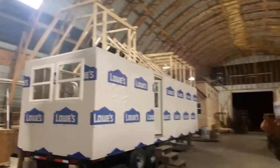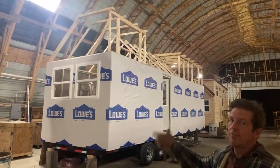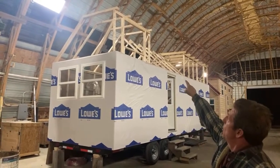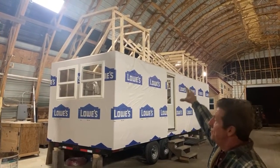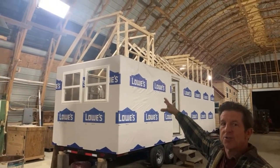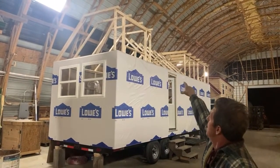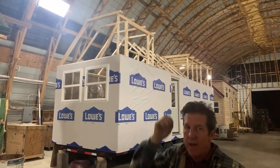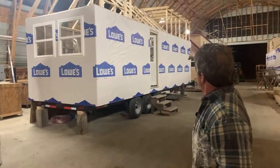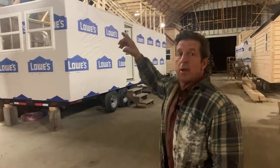Okay, framing the walls like we were down here at this one. Sheet and put your windows in. Super simple. These rafters up here are pre-cut. Those are dormer rafters. We have jigs that you build in. We pre-thought this out for him before he got here. So these guys have all these. They just do them to what we say. That dormer wall up there, we tell them how tall to build it. Then you got a double rafter back there, almost like a craftsman style on the plans. You just follow the plans.